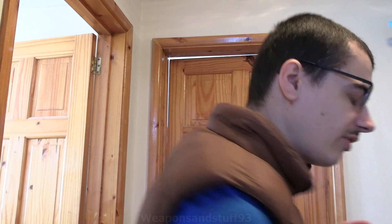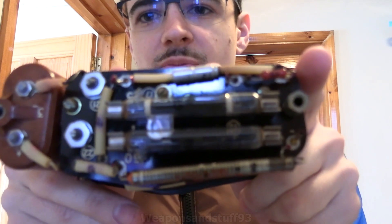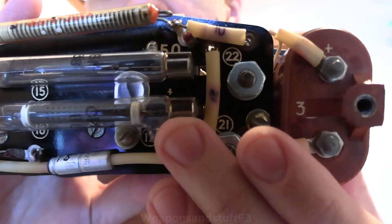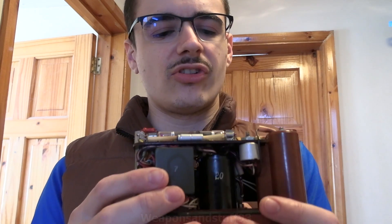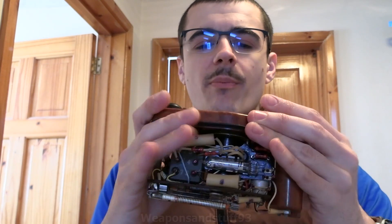Let's turn the audio off for a minute so you can see it. It's quite a nice little unit — it just has two GM tubes that sit there. If I turn it the correct way up, you'll see one of them says 50, one says 1.5. The 1.5 Roentgen tube is the bottom one there, which I assume is the only one that takes a beta reading. Then the one above it is the 50 Roentgen per hour tube. These are very old, different kinds of Soviet tubes — if you're familiar with more modern Geiger counter tubes or even Soviet ones, they didn't have the little bit where they used to fill them up. This is like a prior-to-SBM-20 Geiger tube.